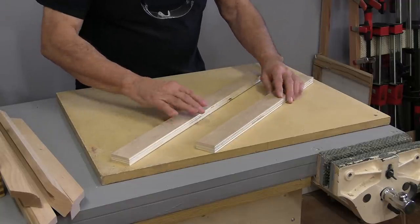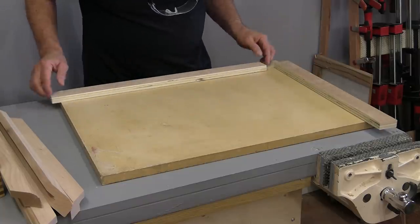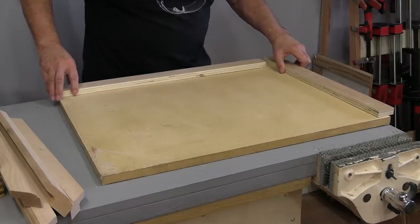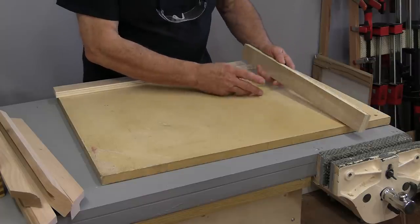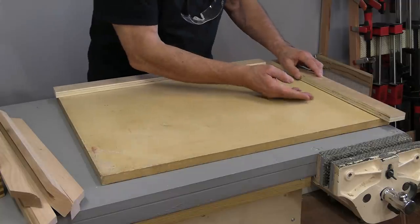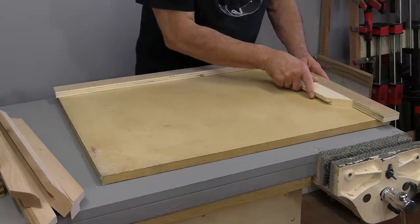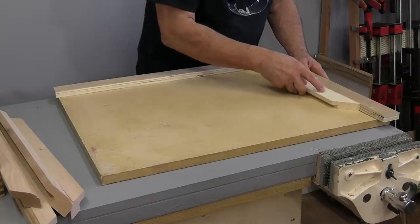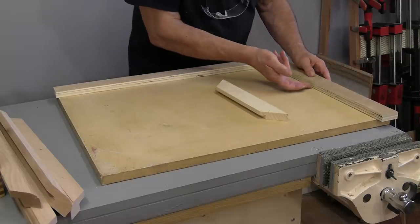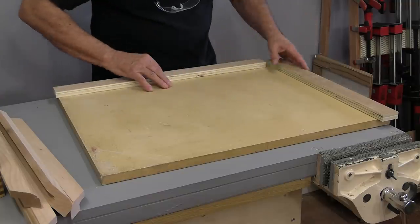The other thing you're going to need is just a couple of pieces of wood. I prefer to use plywood for this because plywood is stable — we're going to be gluing and tacking it down. The first thing we want to do with our pieces is take a little bit of an edge off one side, because when it's laying flat, little bits of dirt, dust, and sawdust can get in there and give you a false reading. So if we take just a little bit of that edge away, any dust will slide underneath, and that makes sure we always get a good reading when aligning wood to it.